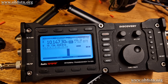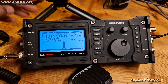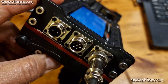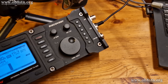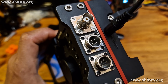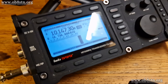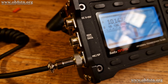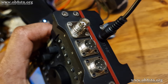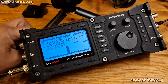Let's go back and take a look at the original TX500. In some of my early blog posts and videos, I think I had two complaints. The main complaint was the fact that we had connectors on both sides — data on one side, power on one side, the microphone on one side, CAT control on the other side, the antenna on the other side. All of these wires can be very frustrating for the data modes operator in the field. A well-designed ManPortable radio should always keep those connectors to the rear or to one side, definitely not spread around both sides.